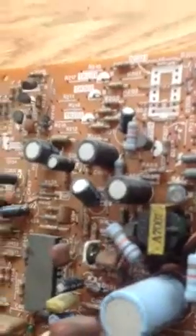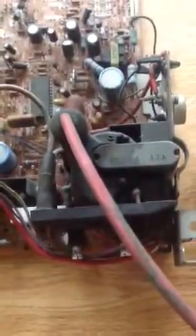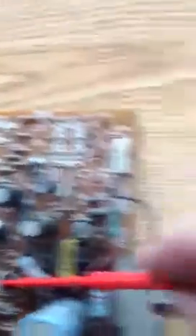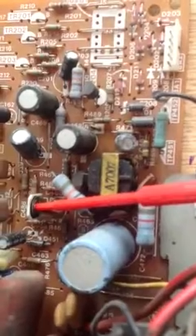The horizontal pot — some genius has put it sideways over here on what would be the right side of the console. So here's the flyback, and behind all of this junk is the horizontal hold. You have to approach it from the side like this, get the screwdriver in like that, and then you can rotate it.